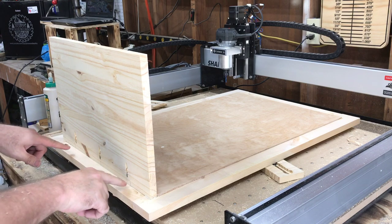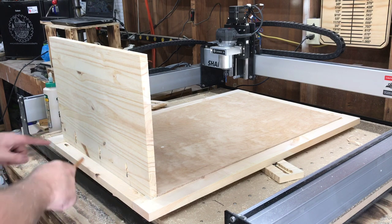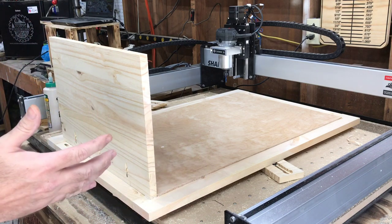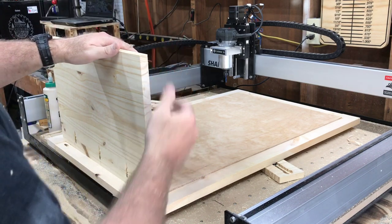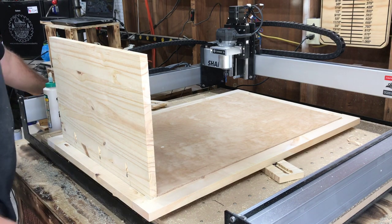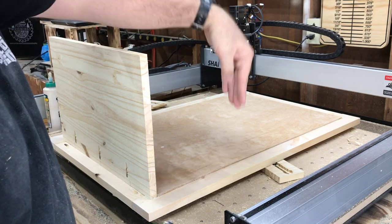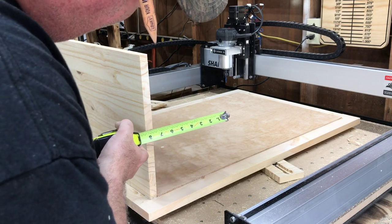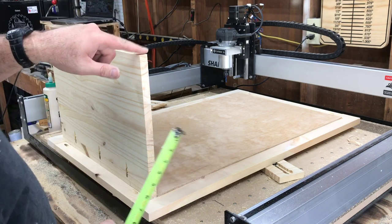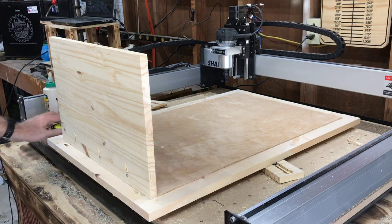I drilled three pocket holes and marked where to avoid drilling through existing pocket holes. Put glue on it, screwed it down, and made it as wide as that piece. Now I need to come up with a side brace to hold it. Instead of a fancy diagonal, I've got a different plan — I'm gonna cut a square piece about eight inches long and attach it, and I'll show you why that makes sense in a minute.